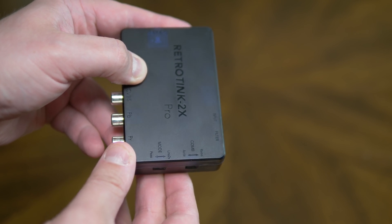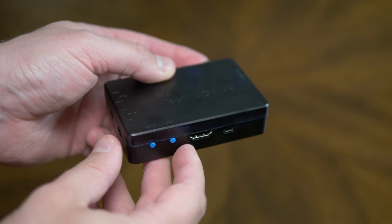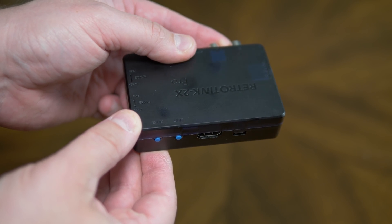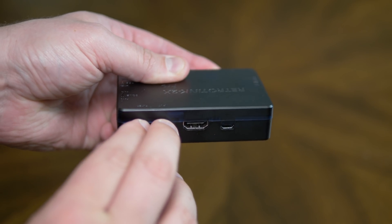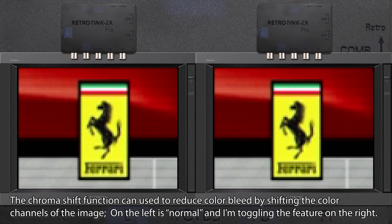In back there's power, full-sized HDMI out, and two buttons. One toggles between the three inputs like the original Tinks, but there's some new functionality. Pressing both buttons together activates a field shift for 480i modes. Unlike the previous Tinks, there's no smoothing filter on the M; however, pressing the filter button in both 240p and 480i modes will activate scan lines with a different style for each resolution. Pressing that same button when 480p content is passed through will toggle a chroma adjustment — another new feature. It's the only RetroTINK product that can pass through 480p. So let's go over these features and see how they work.